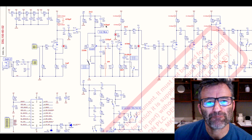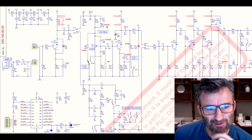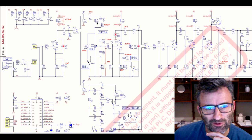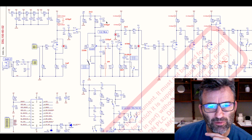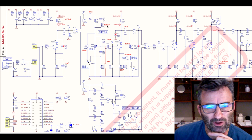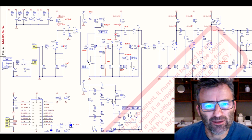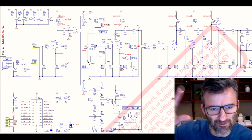you've got about 380, 390 picofarad. What I was trying to simulate here is effectively what you would see in a JCM800 when you come out of that first gain stage, before it comes into the gain pot. You've got a 470K resistor bypassed with a 470 picofarad ceramic cap. That's exactly what I'm doing there. You could pull that out, but when I did that, I had 390 picofarad there. To my ears, it sounded about where I wanted it. The higher value, of course, lets through slightly lower frequencies in that high-end range.